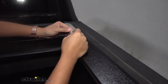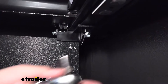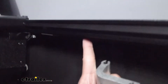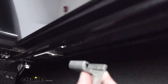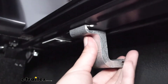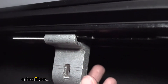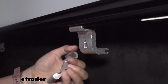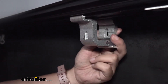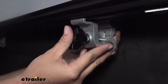You'll have a bolt — put a split washer and then a flat washer on it and secure from underneath. Once threaded on, use a 7/16-inch wrench or socket to tighten it down. Then attach the clamps: there's an opening where the clamps fit in. Get it parallel to the rail, slide it forward or backward to line it up beside the plate, then secure the back of the clamp with a knob, split washer, flat washer, and a barrel nut in the back.